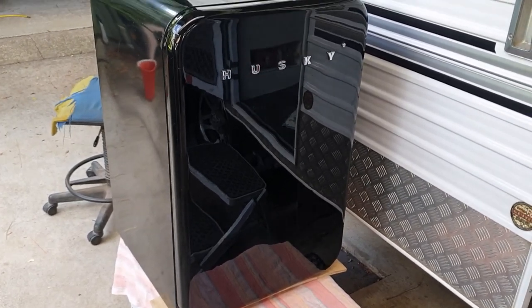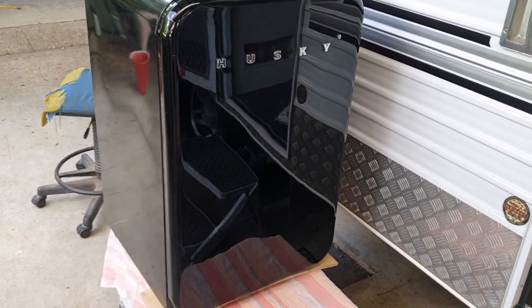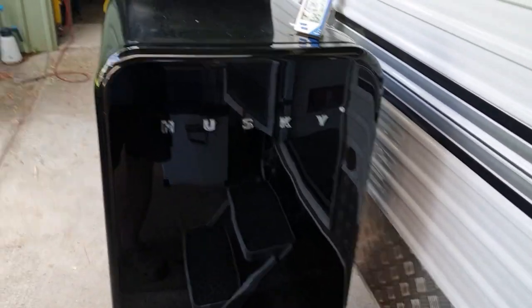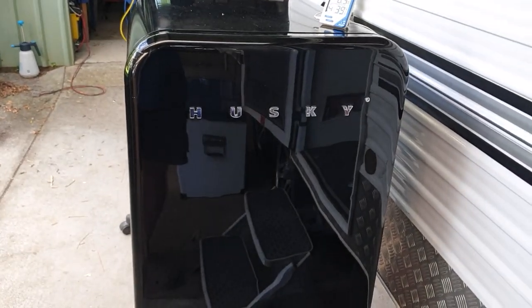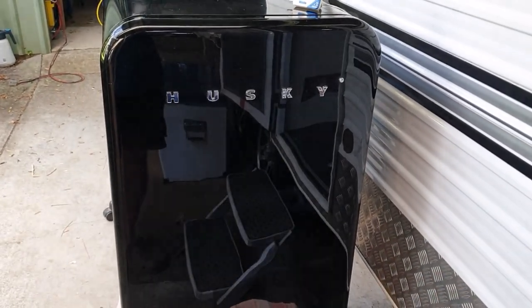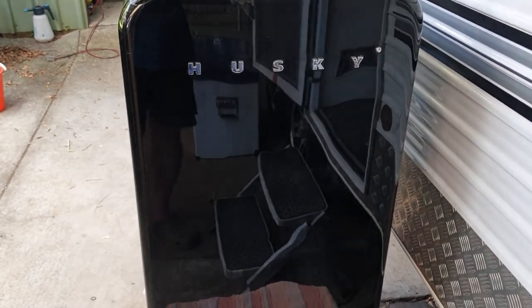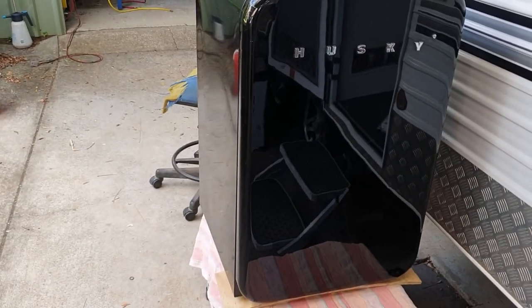This one works great — it pulls down temperature very quickly and on average draws around 2 amps per hour depending on how often you open the door. It is certainly feasible to do a 12 volt conversion, but it must meet the criteria: it must NOT be frost-free. It must be a cyclic defrost style — this older style of fridge with no fans, no heater elements. Thanks for watching, hope that helps — put any questions in the comments.